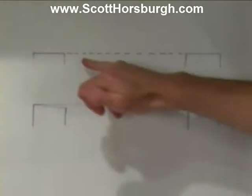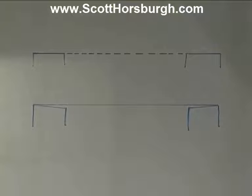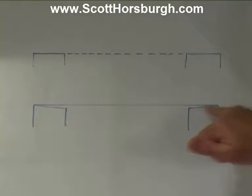When I say a ray of light, this is what I mean. This is an end frame. So these are the legs, and this is that panel, the veneered panel, and there's also a rail through here. That would be perfect to have it dead flat like that. But to make sure that the top will sit very tightly against all of the outside edges, when I say angled inwards, that is an exaggeration just to show you what I mean. So if you put your square on from the outside face, you would see a ray of light under there. So it's very slightly angling in.